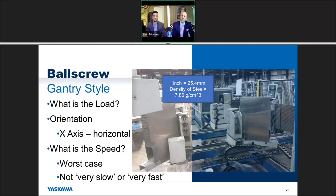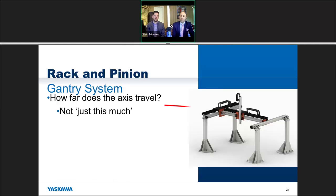If your customer doesn't really know, you can bracket it and give some limitations to get better information. The next question is how far does the axis travel, and again, don't just say 'as much as needed' — you need units. After that, what is the required precision? Can it be within a certain number of inches or millimeters? Some applications are fine with a quarter inch; others need to get into submicron precision.